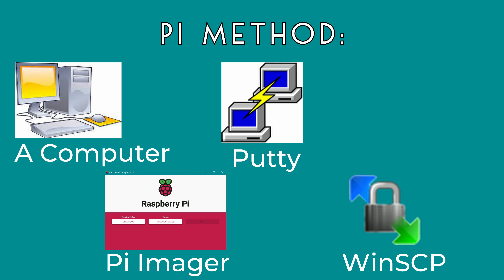Next up is measuring resonances — this is the input shaper I was talking about earlier. They make it super easy to do, and luckily this cable can disconnect from the accelerometer. I mounted it onto the printhead, because you'll want to re-run this if you move your printer around a lot — it'll have different resonances on a table versus on the ground, on tile versus a different surface. Most people will set their printer on a table and leave it there, so for that you could run it once and then take off the accelerometer.